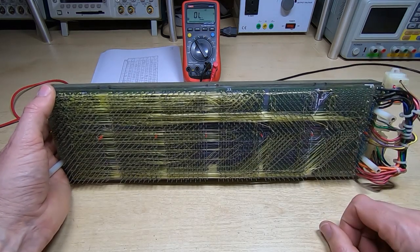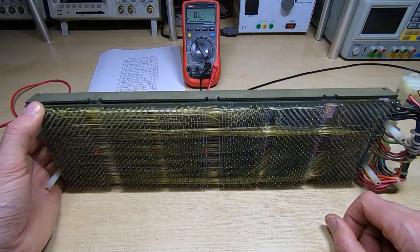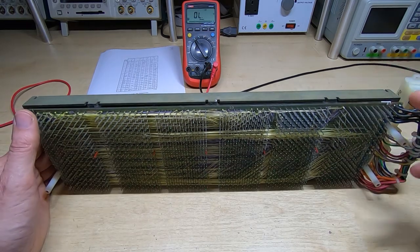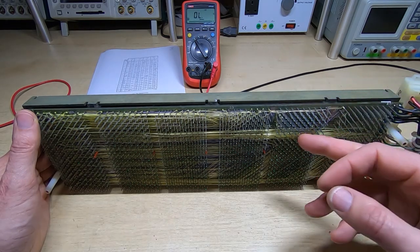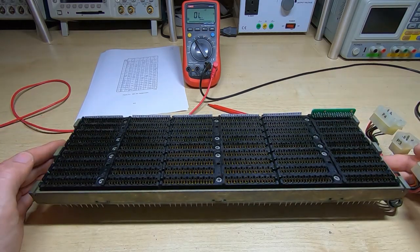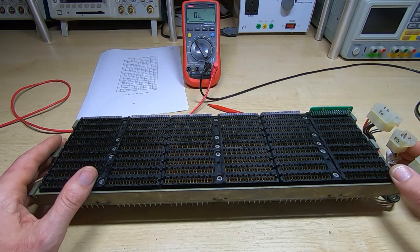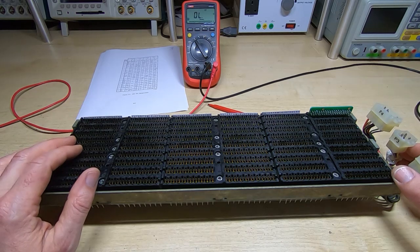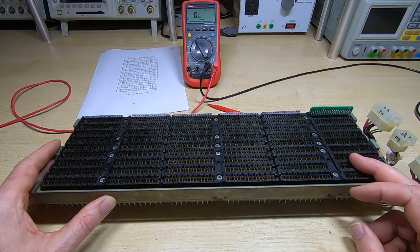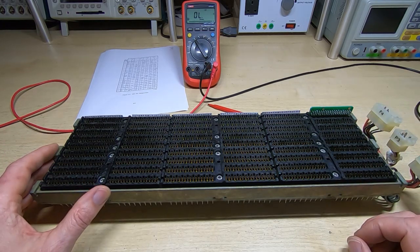In theory you could leave the wire wrap there, but it's best to take it off because if one of the wires breaks it could short out on something. Another option is to use the same connectors but have all the connections duplicated on the new board and use it in tandem with the existing board. You could of course opt to desolder all the connectors and just swap the entire board, but I think that'll be a difficult task and you'd most likely damage the connectors. So those seem to be the best solutions. My personal preference is to go for a new board that contains all the required connections for the CPU backplane. The problem is one of time and cost — it would take maybe a month's work, which I'm quite happy to do, but the cost of a four-layer board of this size even for initial prototyping is going to be quite high, and then there's the issue of testing it.